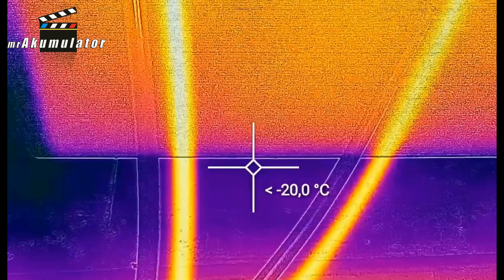Why did this actually happen? It happened because I placed the discharged battery in the freezer. The temperature in the freezer is about minus 25 degrees. The lithium iron phosphate cells reached temperatures of nearly minus 21 degrees. I then connected the clip, set the voltage to 14.5V or 14.6V, 16A, and set up the recording. However, it didn't start with those parameters — it started with just under 14V and 3.7A. And then the blockage occurred — the ability to charge the battery was blocked.